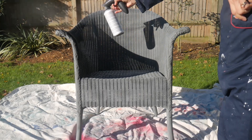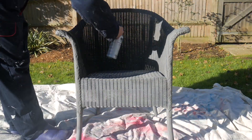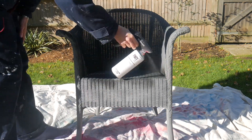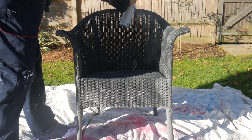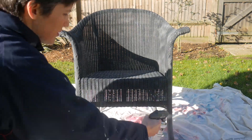Finally we finished with a matte varnish. We also sell a chalk paint wax which needs to be polished and intermittently reapplied like all furniture wax. The varnish however is applied once and will help protect the surface from scratching and water. You can see that in this clip I'm using a spray gun, which is a reasonably priced attachment which we sell.